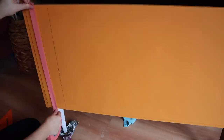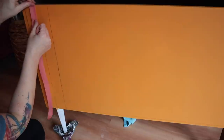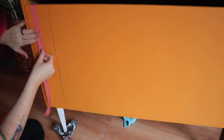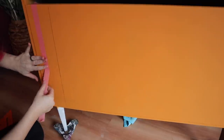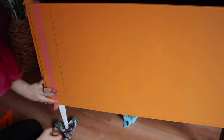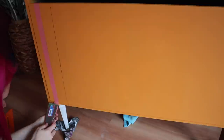I'm gonna go slow on this first stripe so that I can show you how to get a super crisp line. So first of all, I like the Stikk painter's tape. I get that from Amazon and I'll put the link below. But what I do is, because I'm using a pencil, I take my tape and I am carefully lining it up on the outside of that pencil line. And I just want to make sure that it stays straight, and I'm kind of burnishing it down while I go. I am going to use a metal spatula because there's a lip on the bottom of it to get to that 90 degrees to make sure that that tape is butted right up against there so there's no spaces.